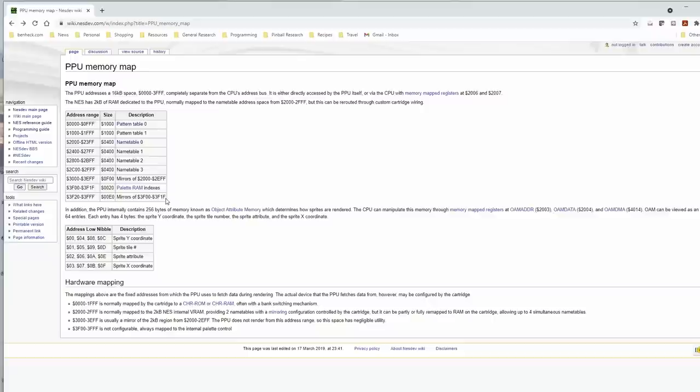One of them's for video, one of them's for data. Yeah, so there's pattern tables and name tables. Name tables is a description in RAM of what characters are on the screen. Like, that tile's over here, that tile's over there, or this tile is, you know, your score. Pattern table holds the graphics, so to speak.